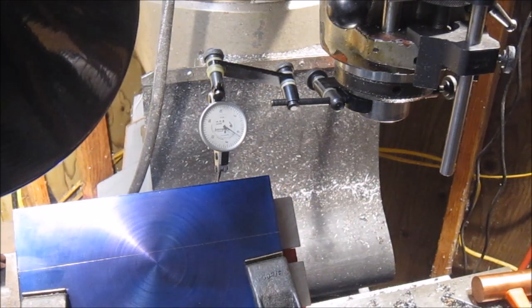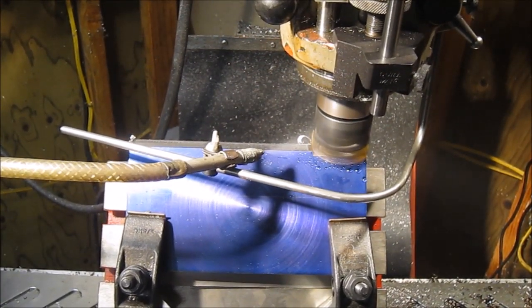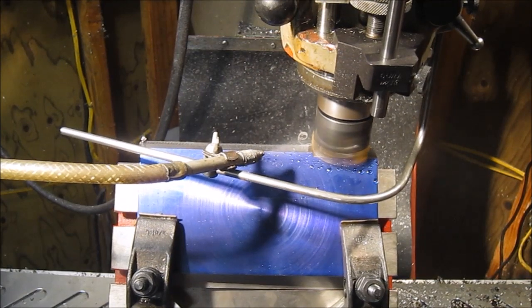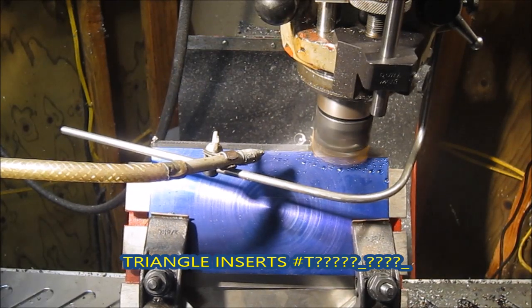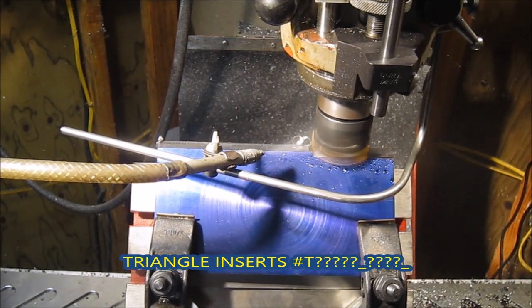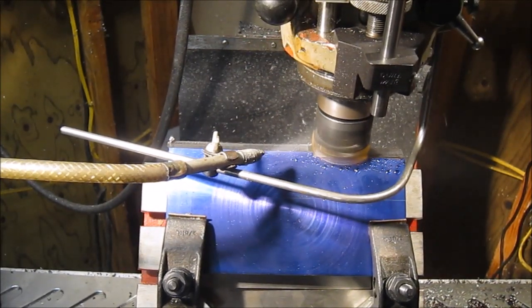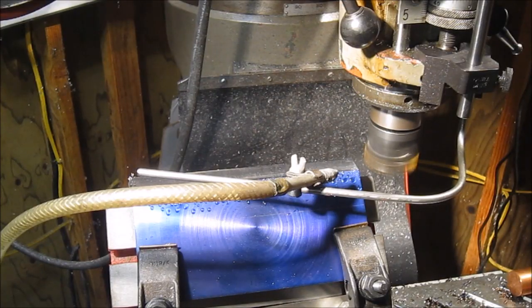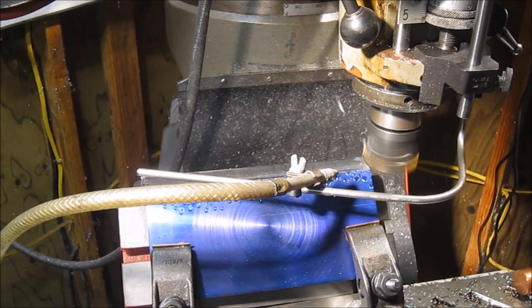All right, get it set up with a milling cutter. This is a 100 thousandths step to cut, with a carbide insert milling setup on this. This is another 100 thousandths pass. We're about an inch wide now. Speed on the cutter is a little over 1,000.